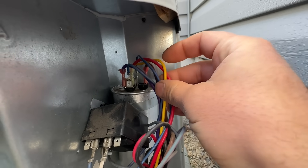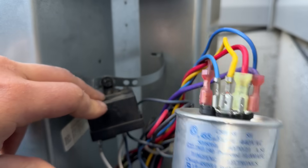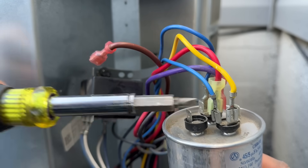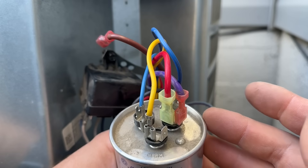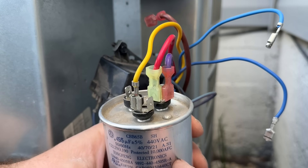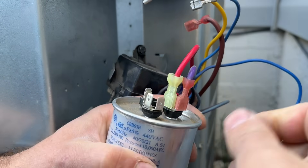It's always a good idea to snap a picture of this from multiple angles if you're not familiar with how the wiring works. Now that it's free hanging, we can go ahead and take off our brown wire — typically you'll only have one wire on the fan terminal, and that's obviously for your fan. I'm going to take my screwdriver and jump all three of these leads. If you had a normal AC unit, you wouldn't have these blue wires — those are for my hard start kit, which I'll cover in a separate video. Typically you would have your brown wire on the fan, one yellow on the hermetic pin, and a purple and red on the C for common.